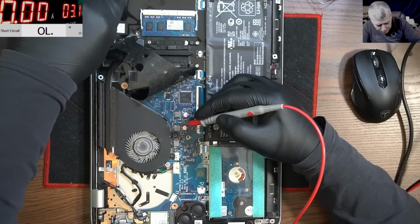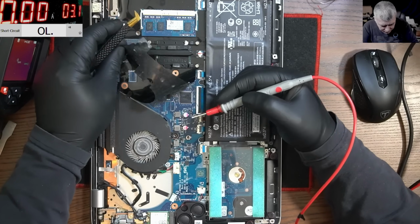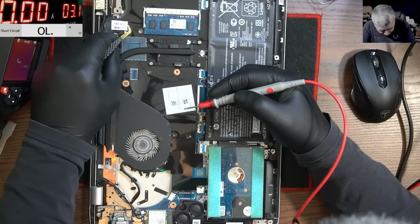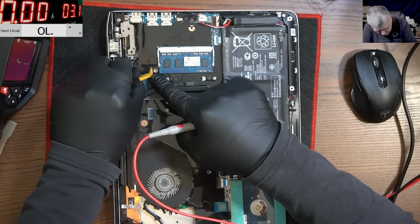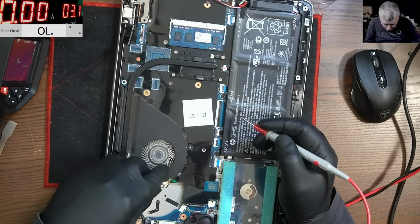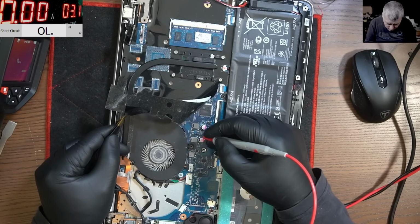So if we unplug the screen, we get rid of the short? Probably. And look, the screen is untouched. I mean, check here. No one opened this before. Let's unplug the screen. So the screen is unplugged. Let's check for sure now. Zero. Yeah, so we don't have a short anymore. Other side, yeah, we have because it's ground, but here we don't have a short.